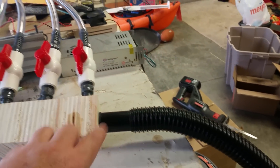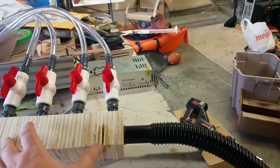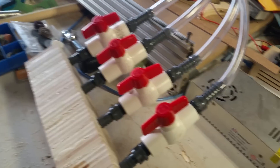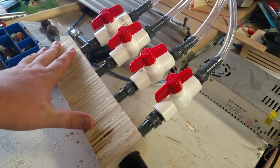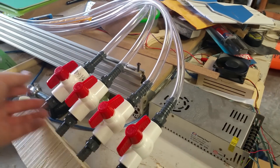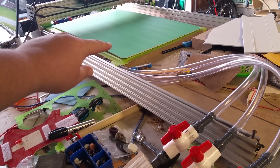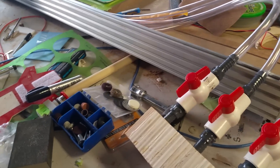I made a manifold block. I have a whole bunch of three-quarter inch plywood laying around at work, so I have a lot of scrap. I was able to go ahead and make basically a bunch of squares and made a cap for the ends. The squares are cut out in the middle — you've got the big square and a little square in the middle — and it goes this way through all these middle pieces, then just cut an opening out here for the hose and drilled all the holes. Again, the cheap fittings from Home Depot work extremely well. This isn't finished yet, but the table is actually set up to where it has four zones — one, two, three, and four — and I can actually turn them off accordingly with the valve setup.